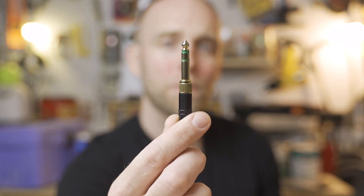I made this video to verify which wires on the inside of the muffs of these Sony MDR 7506 headphones correspond to the tip, ring, and sleeve portions of the cable that comes out the end. I actually want to mod these and get this cable off, so that I can install a jack on the headphones and use any cable I want — like this one or any other 1/8 inch 3.5mm cable.